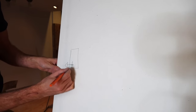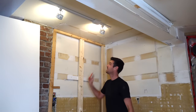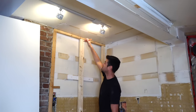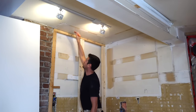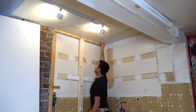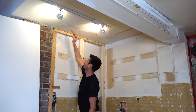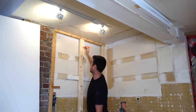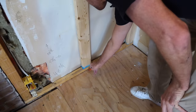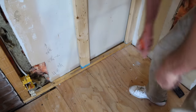The next thing — and this is totally a beginner mistake — is not marking out your joists and studs. If you're doing a ceiling, everywhere on that top plate where a joist is coming, put a little mark right there at center. That way once you get the sheet up you'll be able to find them again. In this case I'm going to mark center right there on the wall, and same thing on the floor — center marked right there.